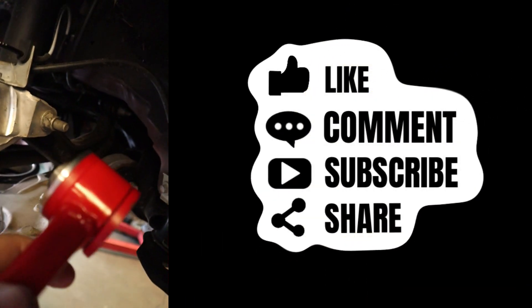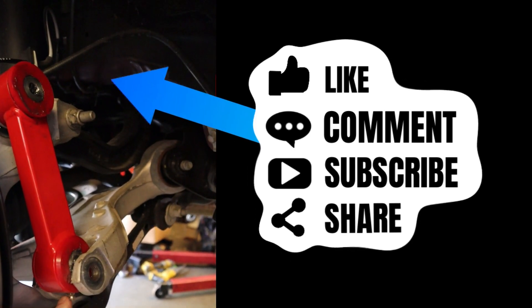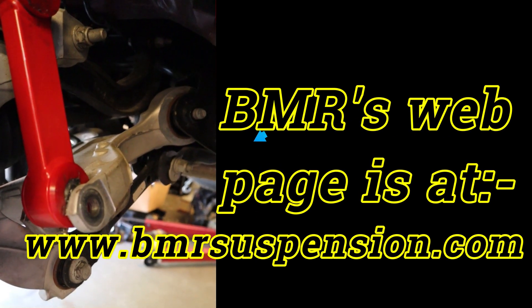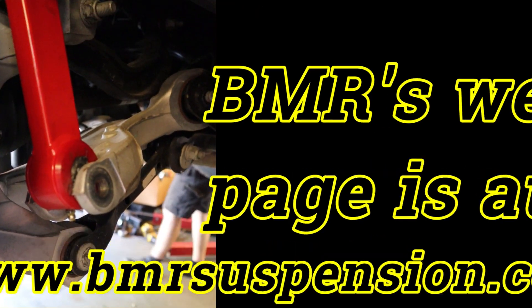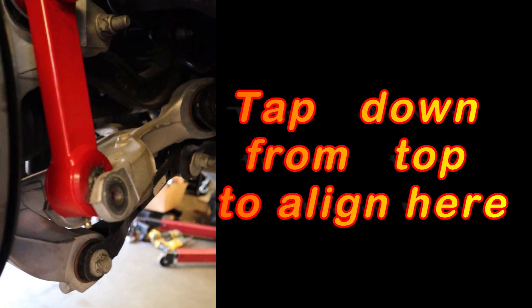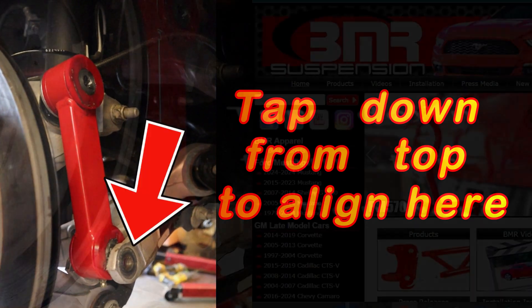Note this conical depression here — be sure you fit this into it so it goes in like that. It's a tight fit, so it's going to take a little tapping with a plastic mallet to get it into place. It might also not be a bad idea to grease this surface and the cone shape there, in case there's any motion — it'll stop any phantom squeak.